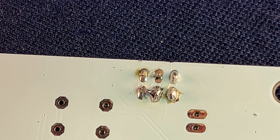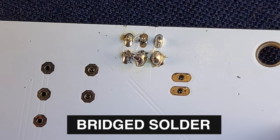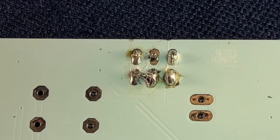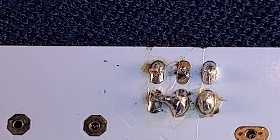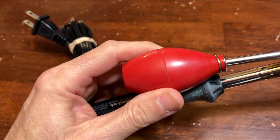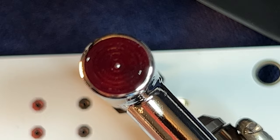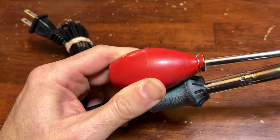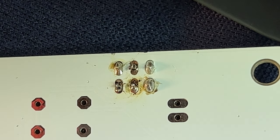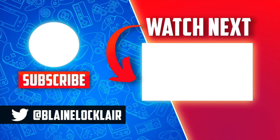The other common problem you may run into is bridging of solder between two component legs — this can happen to both beginning and expert solderers. If you see two legs soldered together, here's how you fix it: plug in your desoldering iron, squeeze the red bulb to create suction inside the iron, place the open-tipped end onto the lead with the excess solder, then release the red bulb to suction away the solder. Remove the desoldering iron and the solder should be removed. Then go back in with the iron and solder to repair the joint. Now that you've got this mastered, check out the next video shown on screen and linked in the description.